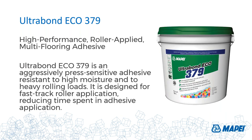Eco 373, introduced about 4 to 5 years ago, is a phenomenal adhesive for LVT installation. It offers a 12-hour working time, fast cure time, and super aggressive high-performance bonding for LVT. It's a multi-functional product that works for carpet tile and LVT and all variations thereof. Eco 379, a newer product, is designed as a pressure-sensitive installation applied with a quarter-inch nap microfiber roller — allowing you to cover large areas faster, get uniform coverage, and eliminate trowel-ridge show-through.